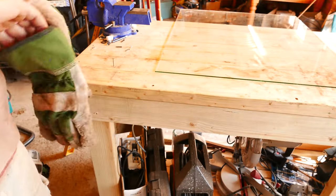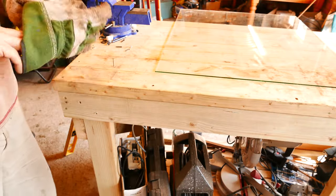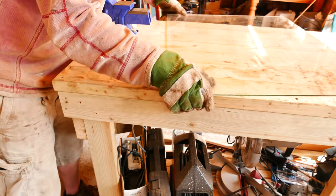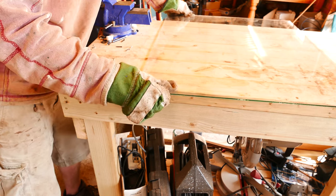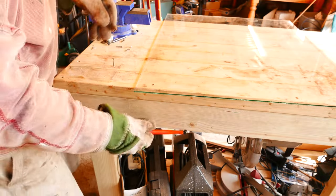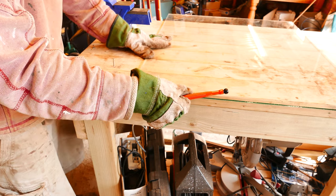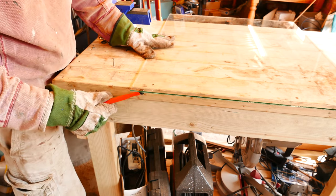That's a pretty good cut. Next step is to put on a pair of gloves and move the glass carefully over the edge of the workbench. Try and align it so that you can use the bench as a guide for the hammer — make sure that the hammer strikes just under the centre of the score that you've made.